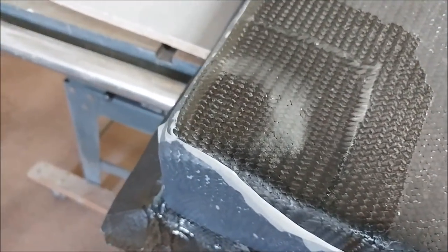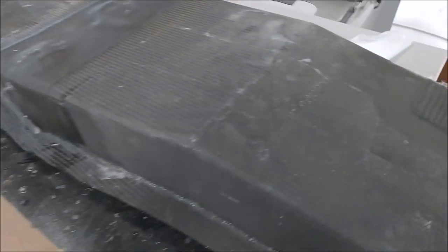Back to the header tank — the hard points have now been covered with a layer of carbon fiber. What remains is to drill them out, screw the fittings into place, then coat the inside of the tank with Jeffco to seal it. After that the closeout panel can go on and the tank will be ready to bolt into place on the aft bulkhead.